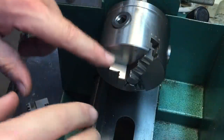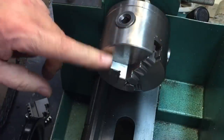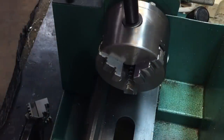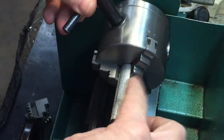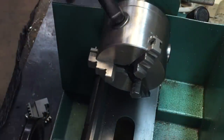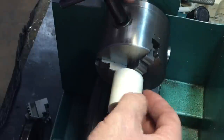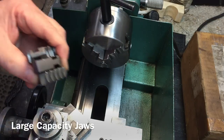If you're new to this, you're going to see that the jaws on the lathe are a kind of a marvel of engineering. There's usually two sets of jaws that come with the chuck. This one here is called the standard jaws — it's a three-jaw chuck, you can count one, two, three. This type of jaws is made to hold things mostly from the outside, clamping here. It's good to about an inch capacity on this particular jaw. Now, what's interesting is you see these little steps on the outside — you can actually clamp something from the inside out. You could put a piece of tubing over here, open it up and hold it from the inside. I'm not crazy about working with that in certain ways, so we're going to switch jaws and put on the other set. I'll show you how these are — this is the second set that comes with it.